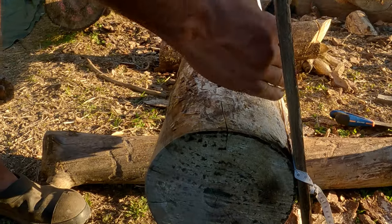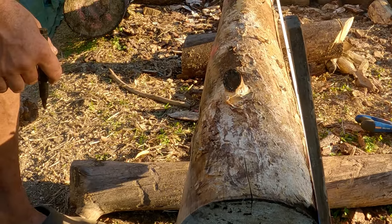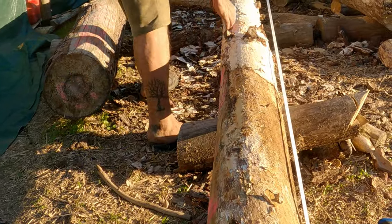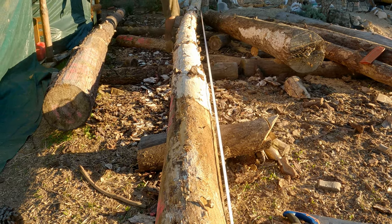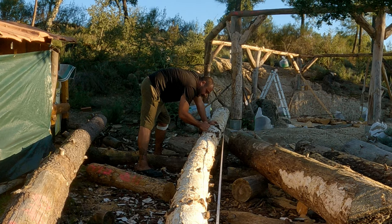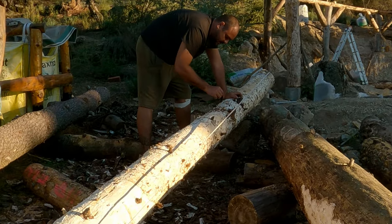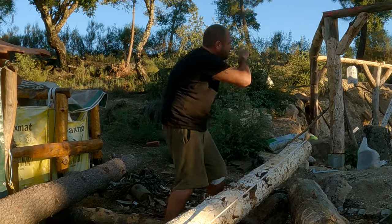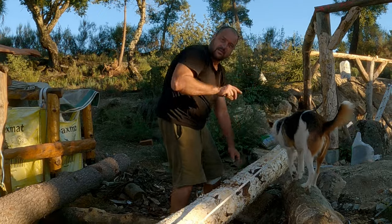See a 20 centimeter wide straight beam pretty much, so the marking is a bit done freehand, you know, but you can see where it is from here all along this side. So this is extra, we're not going to cut it off obviously, so this would be a straight beam, and once I have that reference I know that the middles are going to be the same for the beginning and the end. So now I know how high the central column will have to be. So if this is the center column here, I'm going to cut it like a U and it fits inside. But if I do a string from there to there, that would be that string there. So I can measure this and it'll give me the height.